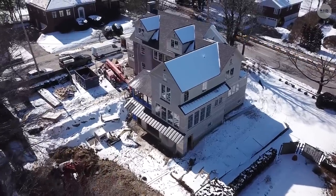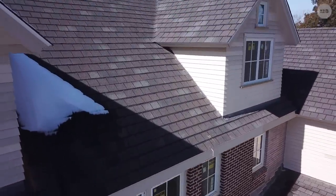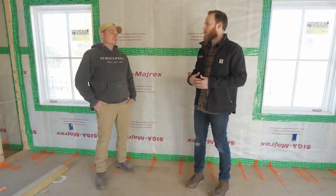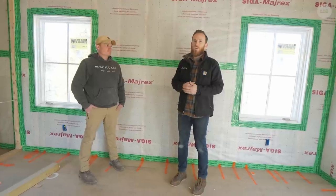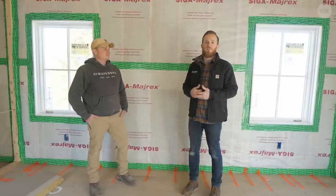This house is a little different — we could have spray-foamed it, but we ran into the existing house being a structural brick wall with no cavity for insulation. We did some research and found that we really don't want to insulate that brick wall because we could trap moisture. Your floor joists are built into the structural wall — if moisture gets stuck in there it will eventually rot that wood. And up here in New England we have the freeze-thaw cycle, so you're talking heaving and even bigger issues. We chose to spray-foam the roof. The reason: it's an old house, the existing roof line was six to eight inches, and we had to sister everything with LVL. We didn't have the opportunity to add exterior insulation to the top of the roof due to architectural elements, so we decided to spray-foam the roof for one consistent material and then reassess our wall cavity situation.